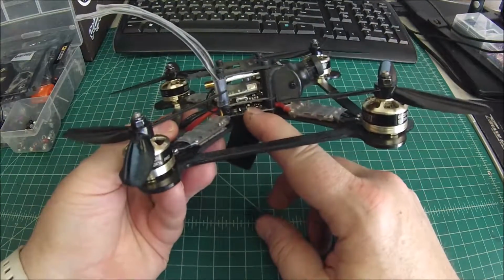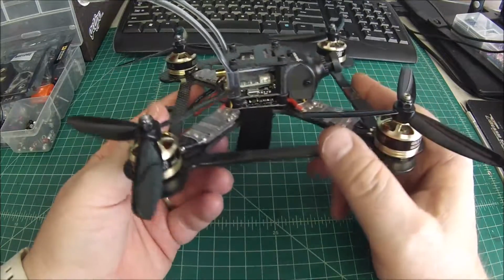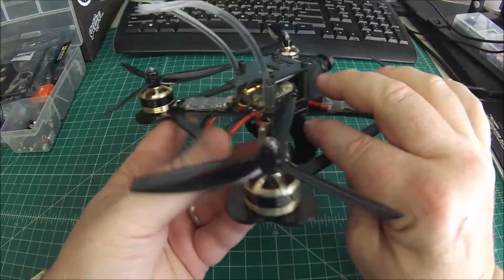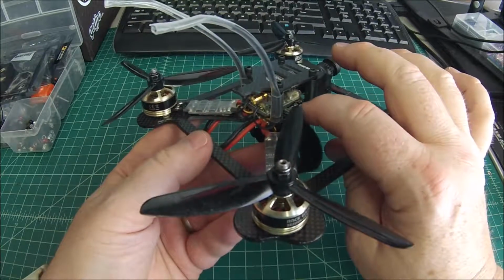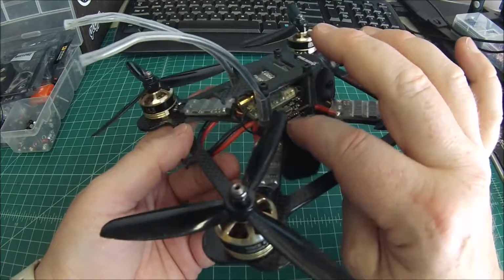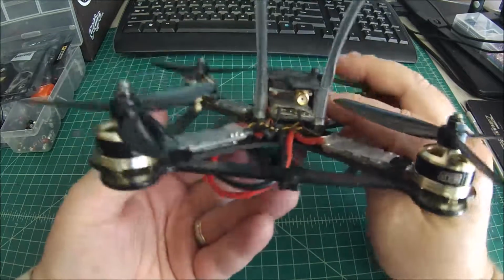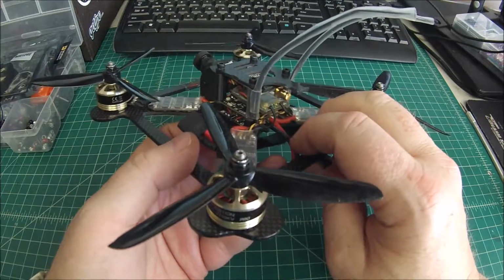Inside here, standard Maytech. Went with the Lux Flight Controller on this, the Lumenier Lux, and I did that because the wiring and everything is so clean on it, and this needs to be a real compact build, so we went that way. As far as the receiver, standard FrSky X4R that's been stripped. When the XSR came out, we all ran those and loved them until we realized, oh crap, my antenna got toasted, and now I'm going to have to solder it back on. So these X4Rs stripped, or bare X4Rs, have come into popularity because you can just plug and unplug a new antenna on there.